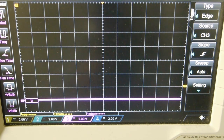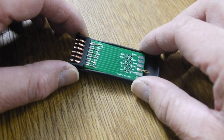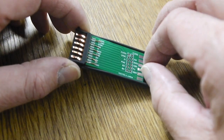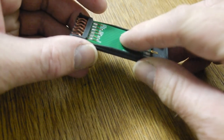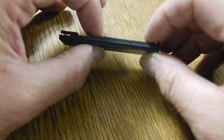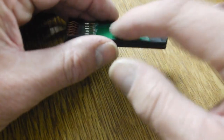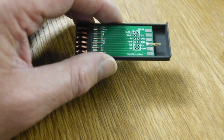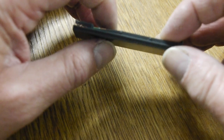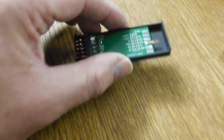Right, I'm going to switch the camera back and go through the connector block. This is the connector and PCB in the case, lower part of the case anyway. Maybe I won't take it out, because I've actually blue tacked it in there to give me the correct height for the back of the PCB. If this isn't raised up and held level, then the connectors are at the wrong angle and it doesn't plug in correctly. So that's something that needs to be done in the real case, but that can be done with the 3D printed case, that's not a problem.